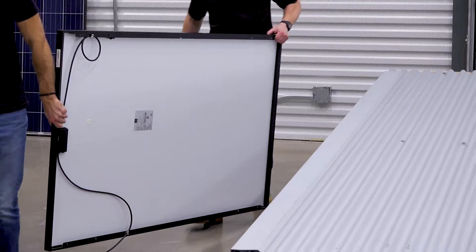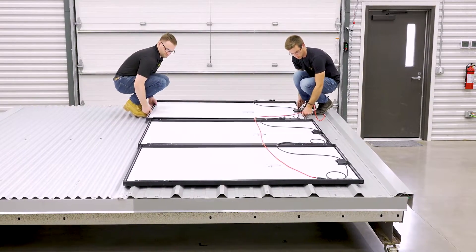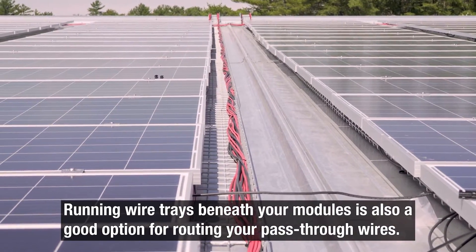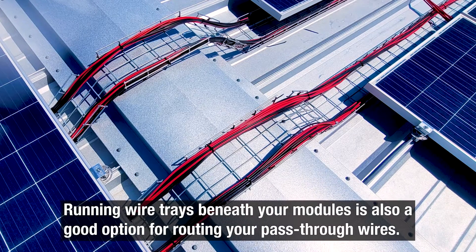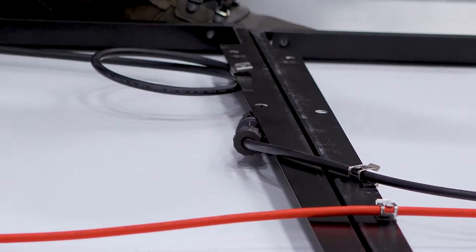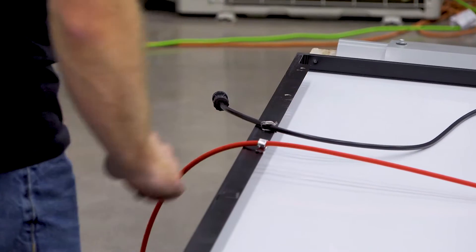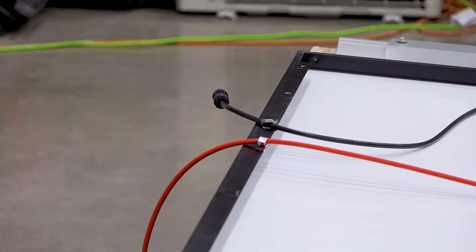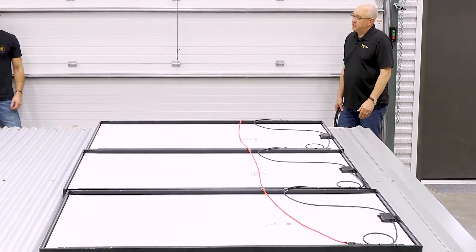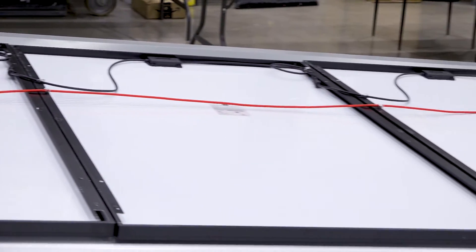Let's get that third module. Another time saver: instead of having to run each pull-through separately down the column and clipping it up, you can run the pull-through down multiple ones through one wire tray — a lot less work for multiple columns. When the string's done, your pull-through wire is already set, and the other string end just plugs into the home run. No wires are touching the roof. It's very easy to do if you plan and prep your modules properly.